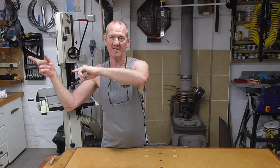Now when doing that, that means you haven't got anything for the starter, your first piece when you put it up. You're stapling one side of the 250mm, not the other, and you can't fasten it. So what I do is blob silicone, pop it up, hold it, and then move along. The last one, same again, blob silicone, hold it up, and then go down.